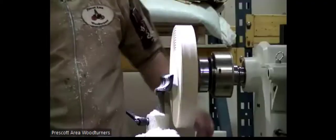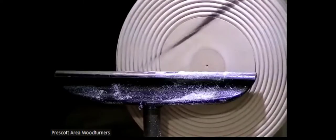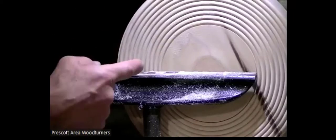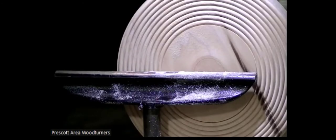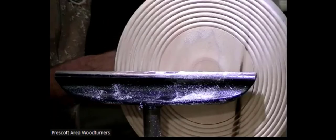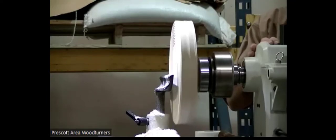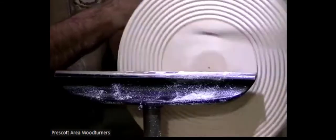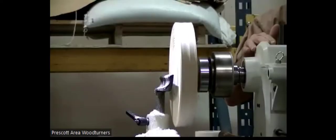Now it's at twelve millimeters — you can really see it's off-center. In my notes there's a big note: keep your hands on this side of the tool rest, otherwise you're going to get whacked. I take the speed all the way down, turn it on, stand out of the way. I can only get up to less than 340 RPM and it's still shaking like mad.